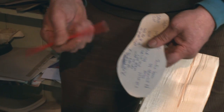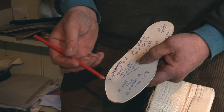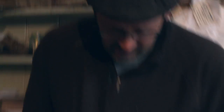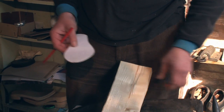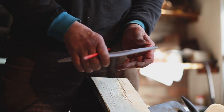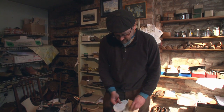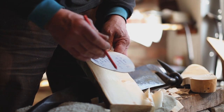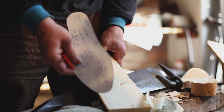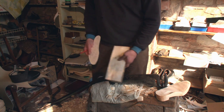I've got this card that I made up. Now her foot isn't this shape, but with the best will in the world, you don't make shoes foot-shaped. You make shoes to be comfortable and to look nice — it's not the same as being the same shape as a foot. She's probably wider here, but when you put the foot in a curve, it becomes narrower in the toe box, so you don't follow it exactly. You need to undercut here and here on clogs — if you don't undercut there, you don't centre the foot and it will wobble. So you undercut it slightly. The toe shape — they might want a very broad toe, or what's called a duck toe, which comes up almost to a point like a duck beak. This is slightly pointed, common round — pretty average.